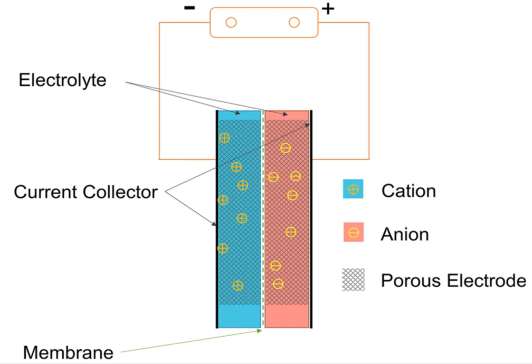Railway. Supercapacitors can be used to supplement batteries in starter systems in diesel railroad locomotives with diesel-electric transmission. The capacitors capture the braking energy of a full stop and deliver the peak current for starting the diesel engine and acceleration of the train, and ensure the stabilization of line voltage. Depending on the driving mode, up to 30% energy saving is possible by recovery of braking energy. Low maintenance and environmentally friendly materials encourage the choice of supercapacitors.